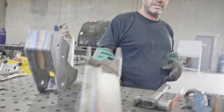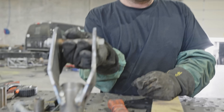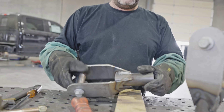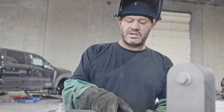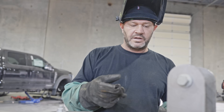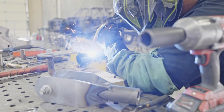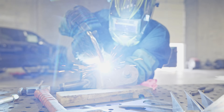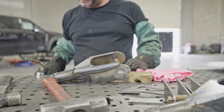These look really good — can't wait to see them on here. I welded the inside of these with the larger welder, and now I'm switching to the smaller wire on the different welder. You're looking for more of a functional weld on the inside, and these outsides are still going to be penetrated — they're just going to be more cosmetic. It allows a lot more time to work a little different stack of the bead.